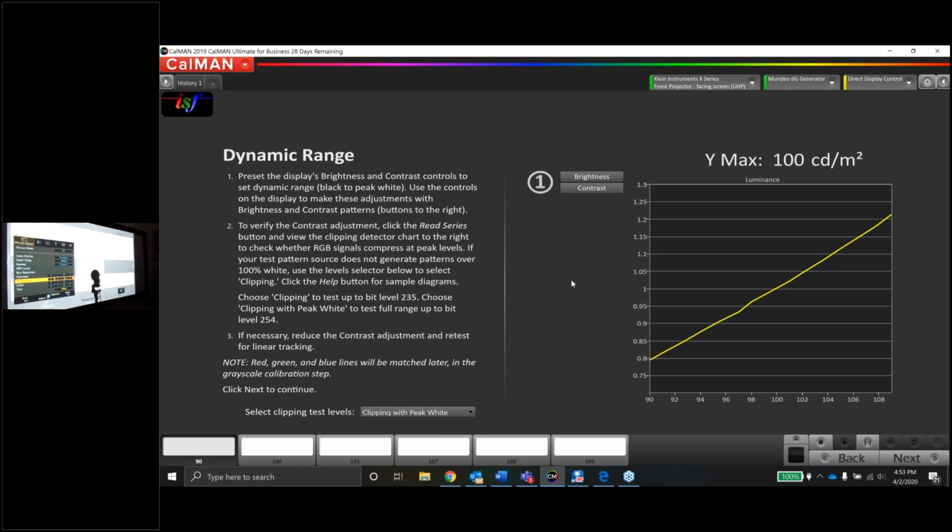This is kind of to be expected based on what Chris told us before, and this totally makes sense. If you take a look at the contrast now, everything is blown out. Let's lower it a little bit, and we can hopefully see at least box 235 there dead center. So I'm lowering the contrast, lowering the contrast, lowering the contrast. And I'm starting to see some boxes on the bottom row. Actually, where do those really start to pop in? Okay, so at contrast at -1, -2 or so, I can see up to box 232. I bring it down to -3, I can see box 233. And I bring it down to -5, -6.